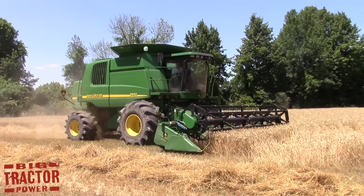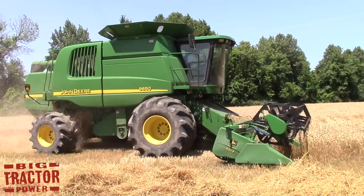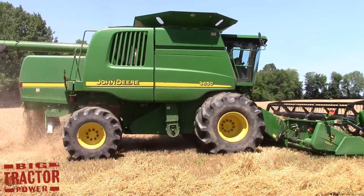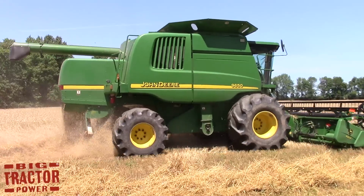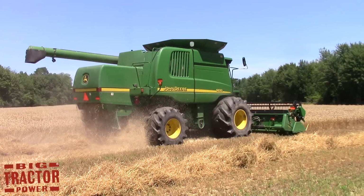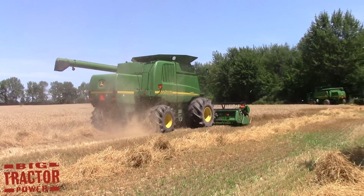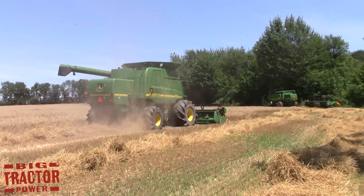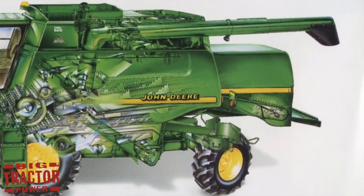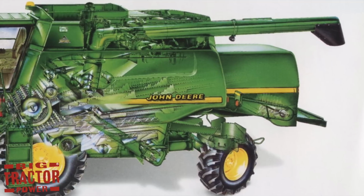The John Deere 9650 was the largest in the walker lineup and really the pinnacle of a lot of history in that walker design. It has 11,625 square inches of walker area. It allows for great performance in cleaning grain with a steep step design that provides aggressive separation as soon as the material enters the straw walker. A 6-inch crankshaft throws and fluffs the crop mat and provides a vigorous separation action as the crop moves through the machine.